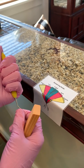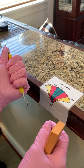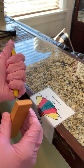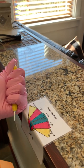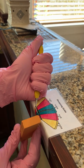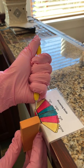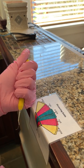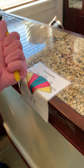One thing people don't always understand is how important it is to get really steady on a surface when you sharpen. If you're up in the air, you're going to do little wobbles and it's going to change the angle without you even realizing it. Also, students want to be really precise with the angles and get too close, which rips up the guide. You need to come away from the guide a little bit and get yourself really sturdy on the surface.